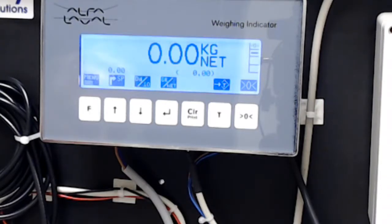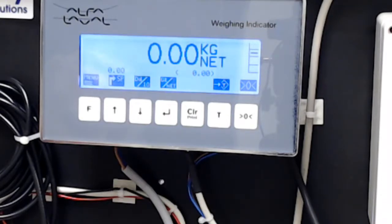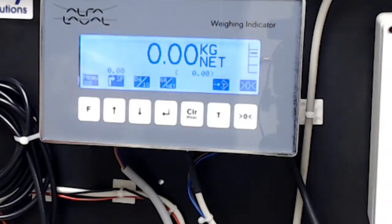There's another box below that which only shows an indicator when its function is active — you'll see 'ZT' appear occasionally, which stands for zero tracking. When the system moves off of absolute zero, a routine I've activated tells the system to zero out automatically, provided it's within a certain range of zero. For example, if it's only off by 0.01, it'll return to zero automatically. But if it's off by half a kilogram, it won't, because obviously something is wrong.